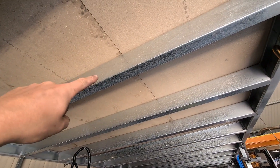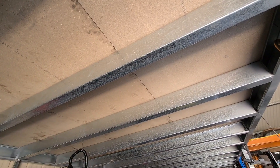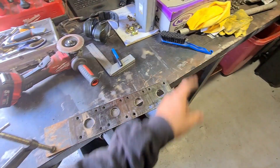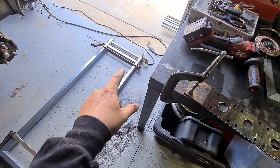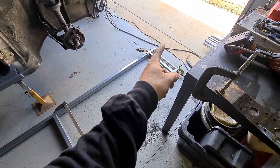So if you want to undo the bar you undo these four bolts, slide that whole pole out, and then the ladder drops free. So I'm just going to cut these into the four pieces that they need to be, weld one to the bar, and then paint all that stuff. Then the ladder is probably cool by now - I need to flip that over and weld the other side of that top rung.